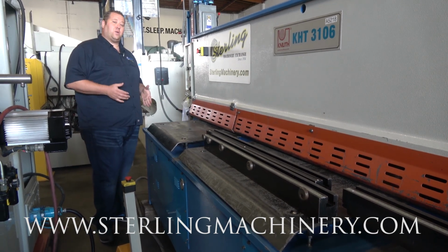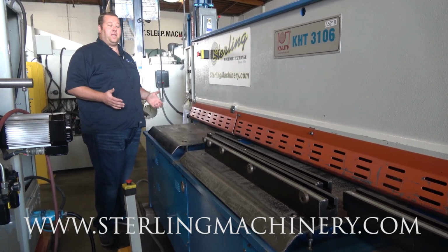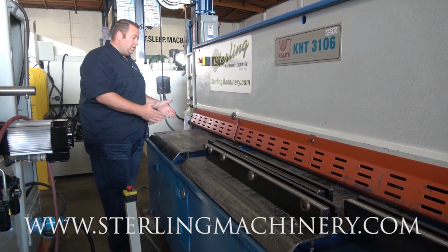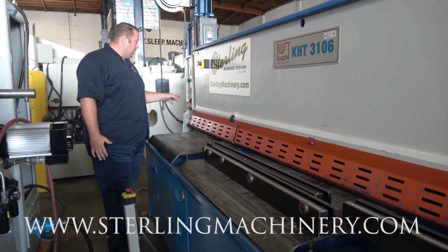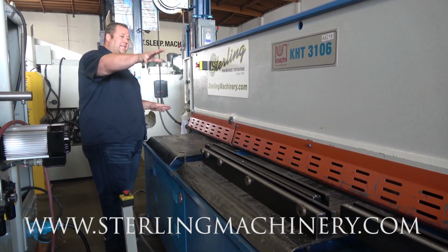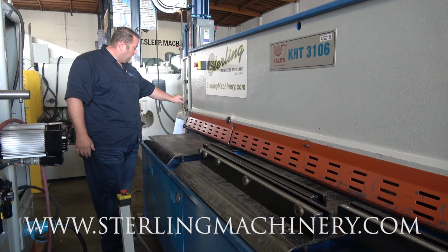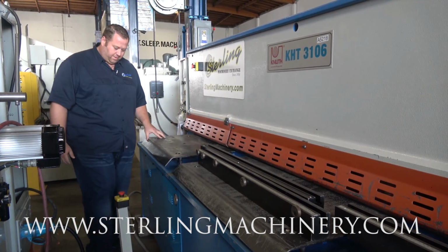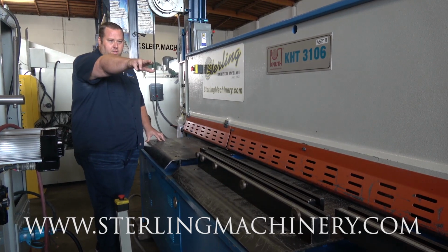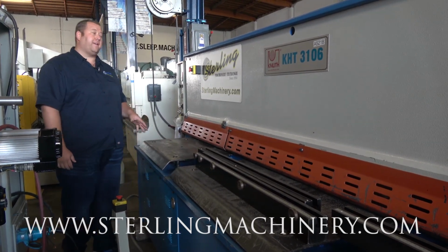Now, being a hydraulic machine, one of my favorite features, if you're cutting a smaller piece, you're not cutting a full 10-foot piece, you just need to do some brackets or something, you can change the stroke length on a hydraulic shear. So right now we have a 10-foot stroke length. We've got it to do the full stroke. Now when I push on the pedal, the blade goes all the way down, cutting the entire 10-foot.